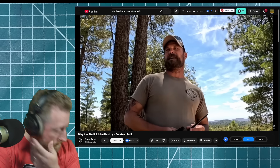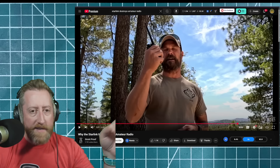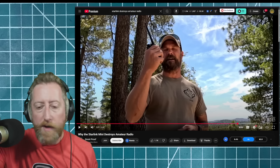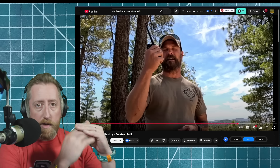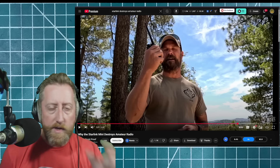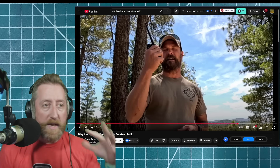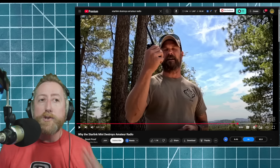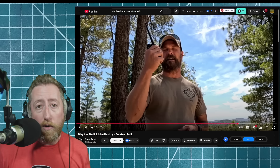Because if you're four hours away from somebody out in the mountains, you're not programming repeaters across half the country trying to talk. This is an incredibly important point. There are radios that will do this for you — GPS-enabled radios. Like an ICOM handheld: you give it an SD card with North American repeaters loaded, and it uses GPS to jump you around based on your location. You can literally scan based on location within the ICOM radio.